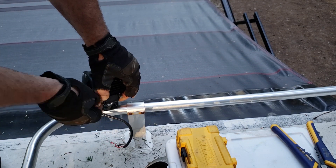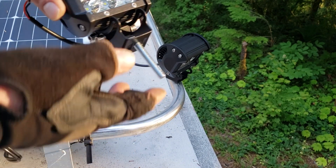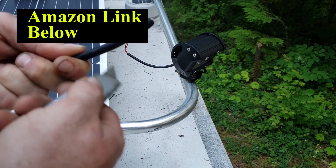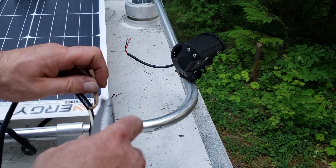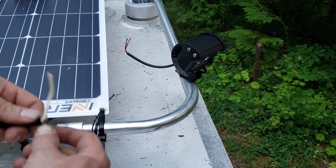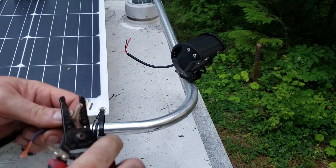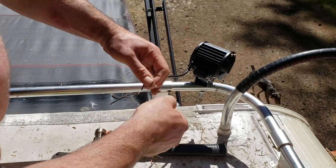Alternatively, you can assemble the light and the four screws ahead of time — just make sure the mounting bolt is in place before you do that or it won't go in. The wire I chose is 14/2 gauge jacketed wire, so it has an external jacket that's UV protected, and inside it has two wires that are also insulated. That's going to protect it from sun and the elements. LEDs don't use a ton of power so this wire is more than enough for this job.